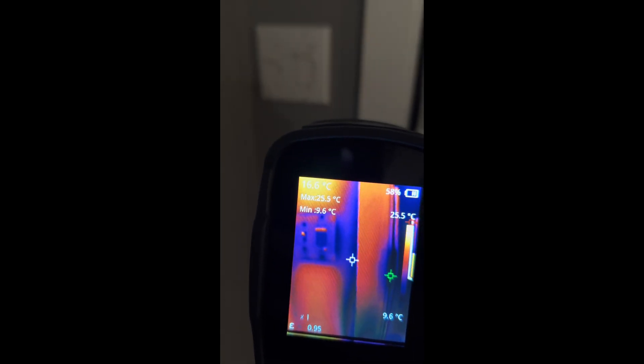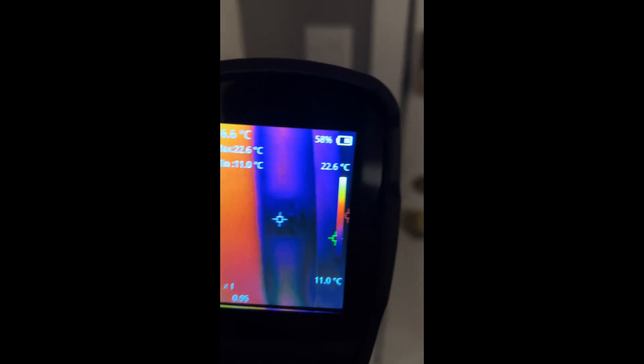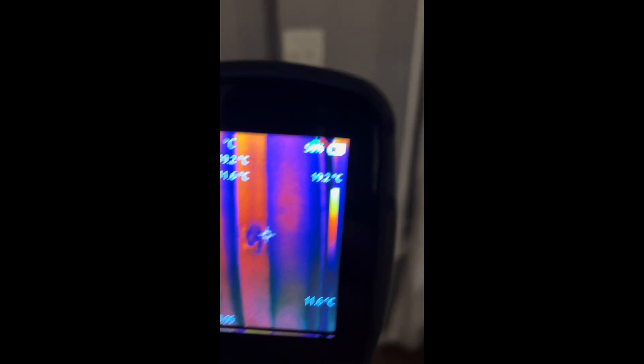The main reason for this is that there's no insulation in the electrical box like there is in the other sections of your exterior walls. By adding these insulating sleeves you'll be increasing insulation and reducing the pathway of air into your home. Here's another example — a wall outlet — and as you can see it's also letting in a significant amount of cold air.